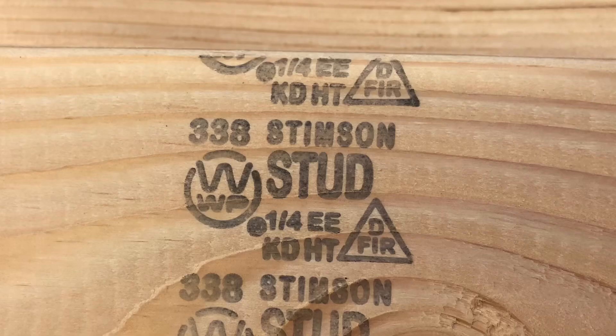When I asked Home Depot staff, they weren't very helpful — which is fair, since this wood is designed for framing houses, not fine furniture. So I called the timber supplier, Stinson, whose name was stamped on the wood. The guy immediately told me to look about a third of the way up the board for a stamp — and sure enough, every single 2x4 and 2x6 was stamped 'D-fir.' Some boards from a different supplier said hemlock. It's stamped right on the wood.